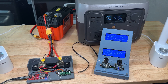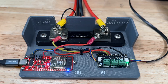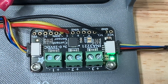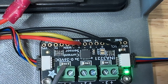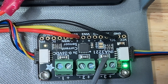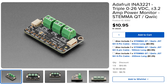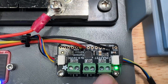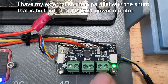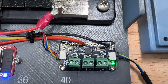In today's video I'm going to show you how I'm using an Arduino and the Adafruit INA3221 power monitor to build a battery tester that can measure battery voltage from 0 to 26 volts across three channels. It can also measure current across three channels. Natively the board is rated for plus or minus 3.2 amps, but I've added an external shunt and should be able to measure plus or minus 100 amps.